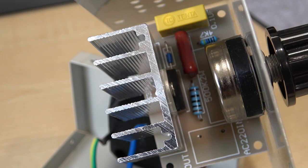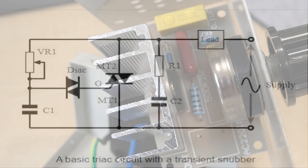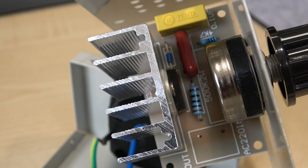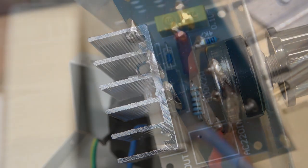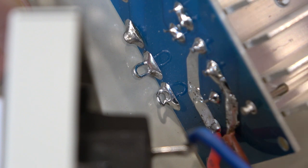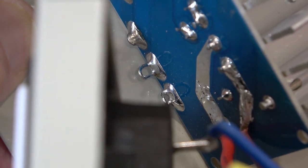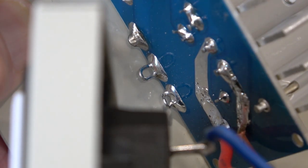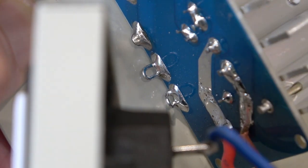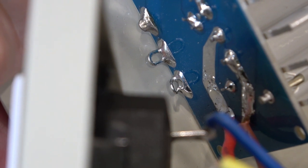There is also no fuse inside the product. Looking down at the PCB, I can see it's basically a bog-standard triac circuit. There is no RF suppression, so any noise that this thing makes is going to be very extensive - it is the cheapest possible way you can make such a circuit. The connections down here are basically mains, and the whole board is movable. If you pull on the wires and pull that down, those terminals will actually touch the metalwork of the case, and as the case isn't earthed, again you are dead.